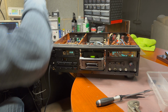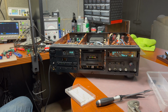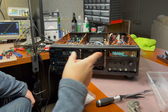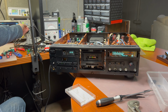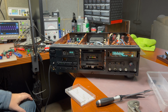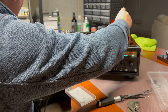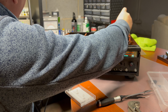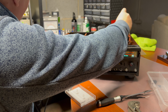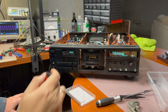Okay. Let's check the level. So this is playback. Zero. It's in phase, good. That level differs a little bit. I will adjust output levels so it would match. So let's, it's maybe 0.3 decibel difference. Now it will be full match and full zeros on the scale.